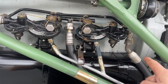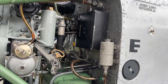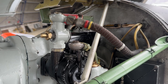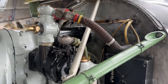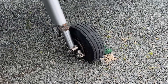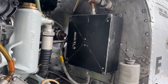The priming handle puts fuel through the main fuel pipe into the inlet manifold on the other side so we can get some priming gas. At the top we've got the vacuum pump, which basically sucks air through the gyroscopically driven instruments — the artificial horizon, the turn and slip, and the gyro compass — to give them the spin they need to operate. Down below is the reservoir for the hydraulic system, which in this case is just the brakes, left and right. And this black box here is a suppressor for the electrical system to stop interference with the radio.